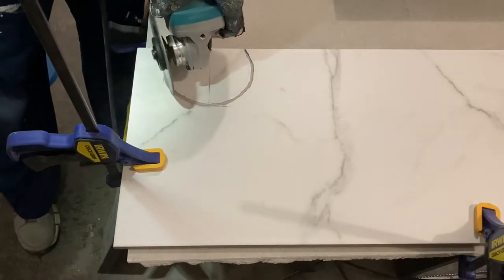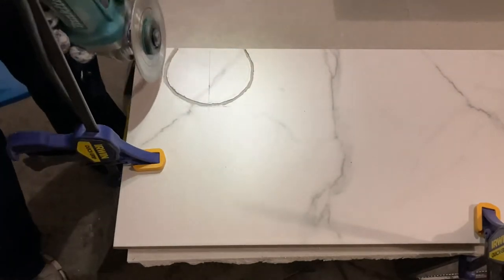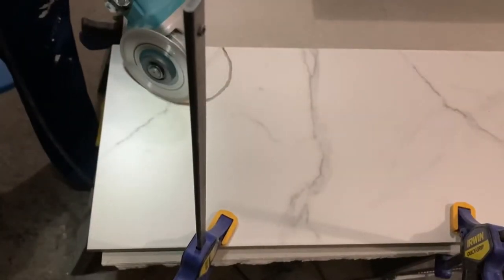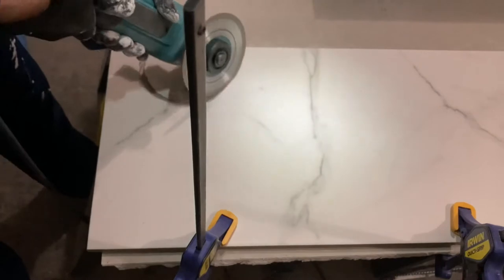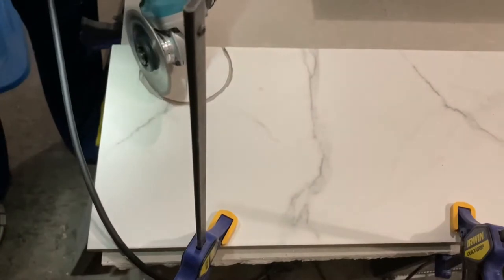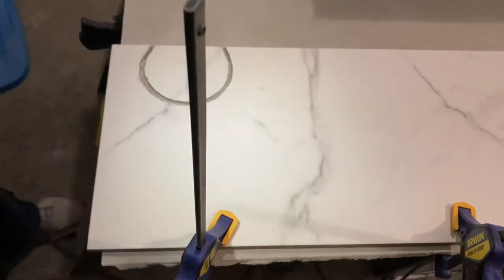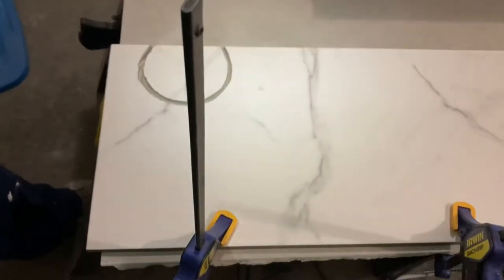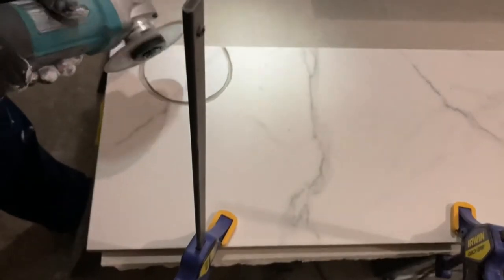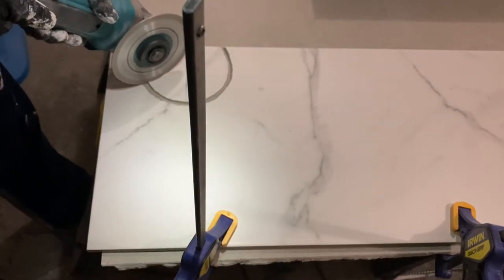Once that's done you can start getting a little more aggressive, turning the angle a little bit more. Obviously that inner part of the circle is junk — we're going to get rid of that, we can damage it and cut it up. The outside though we can't go beyond a certain diameter, otherwise your escutcheon plate for your shower valve won't cover it. You don't want any crack protruding from that. I'm going to make sure this hole is exactly perfect, although it doesn't technically have to be.